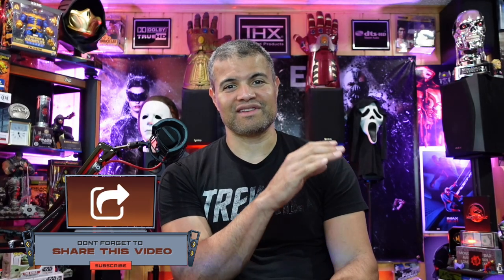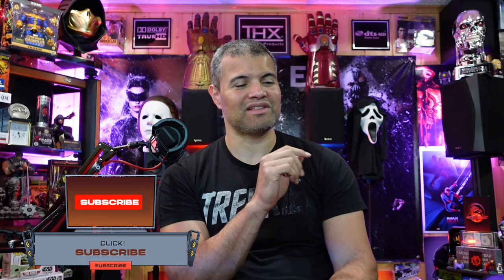I'm not talking about Audyssey with the little puck that comes with the receiver. I'm talking seriously dialing in multiple subwoofers — finding the best locations, matching the subs as closely as possible, and making sure all my seats have good bass response. You can't do that with just one single mic and the receiver. It tries to balance things out but won't give you the right configuration for bass to sound great everywhere. With Audyssey it'll actually drop power from one sub to compensate for another, so they're all fighting each other.